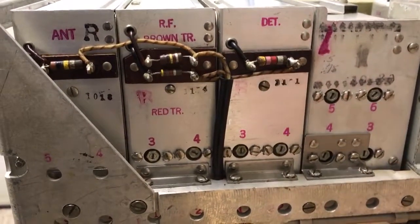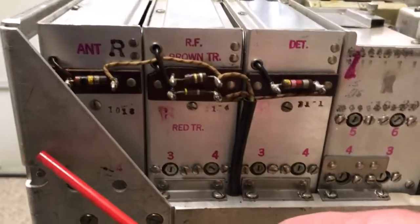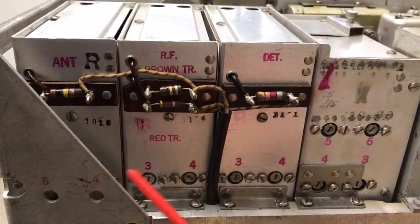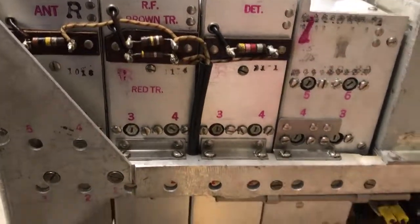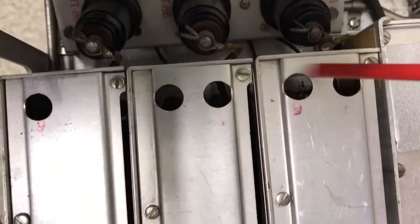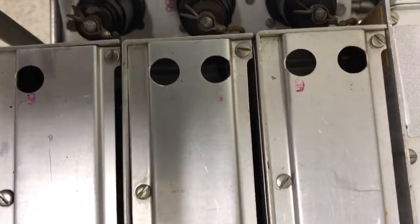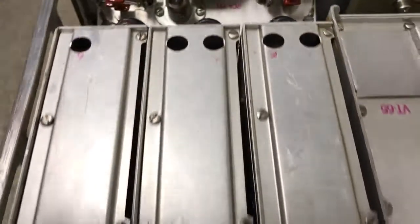You already did the oscillator setting. Then you go to band two and do the same thing — tune up the screws on the high side of the band for the trimmers that say number two. Then you do likewise for each band. Just one little caution: on bands five and six, some of the trimmers are through the top of the cans here. So you just go to the high side of each band and peak these things up, whether you use a signal generator, just a voltmeter, or just your ear on the noise — you'll get good results.